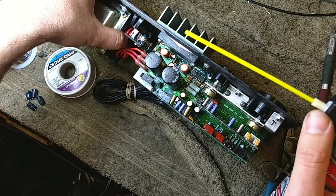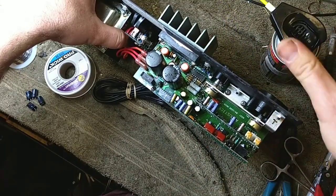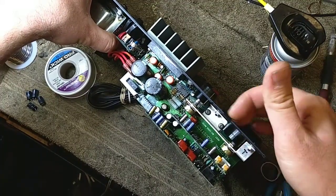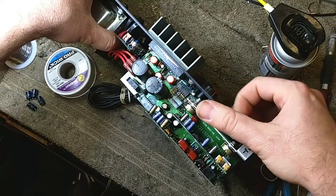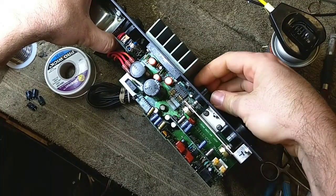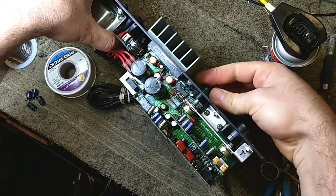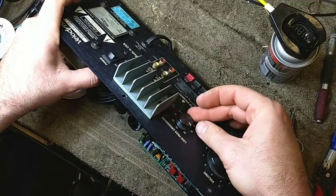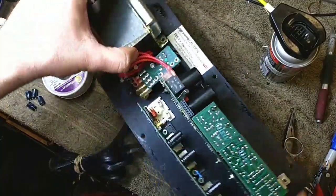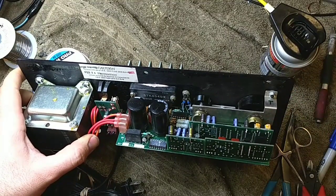Even if I abrade it and use glue, my heat shrink tube extension doesn't work very well. Keg wanted to change something, so be it. I'm just going to spray the contact cleaner in and work these back and forth a bunch. Okay, this was set at about 85 — we'll just put that at minimum. She's got the new caps in and we've got the pots cleaned. Let's put it back in and see what happens.